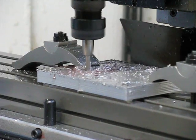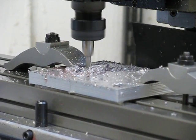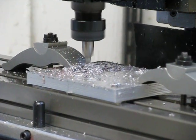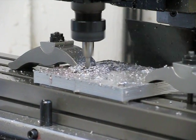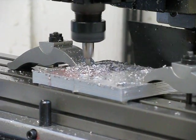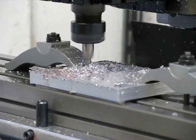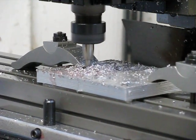This is going at cutting at 30 inches a minute. It's going to make about 40 back-and-forth passes, so it's only taking off around ten-thousandths per slice. It's kind of going in a zig-zag, dropping ten-thousandths of an inch with each pass.